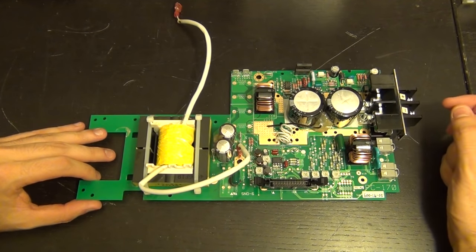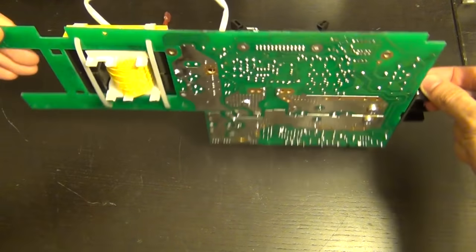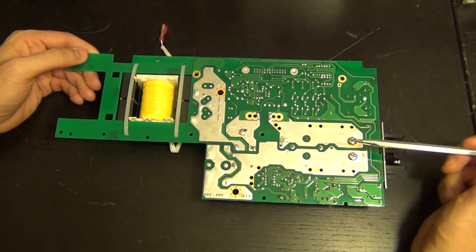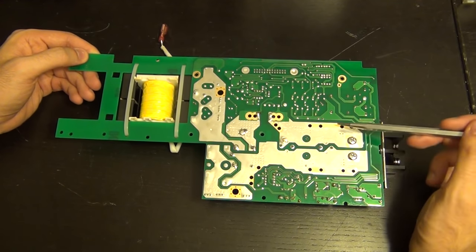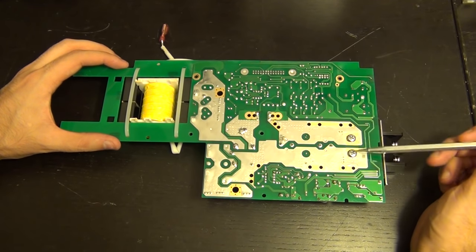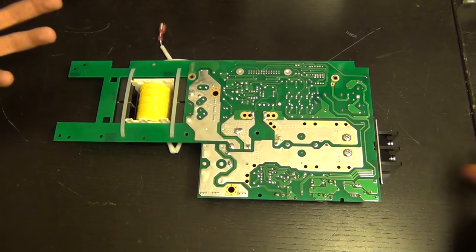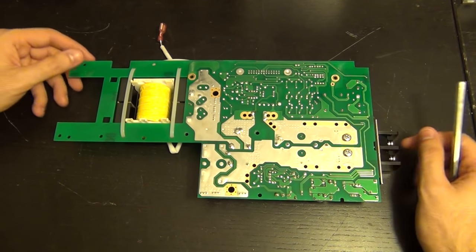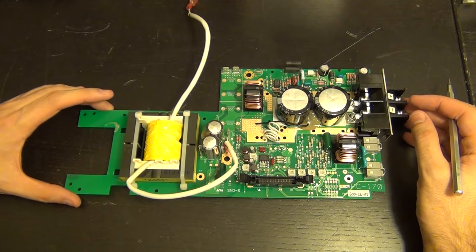Here's the entire output board — a modular design with the failed capacitors visible, and the output terminals. We've disconnected the minimum number of things to remove it from the chassis. At the back you can clearly see the classic technique of adding solder layers to double the PCB traces and increase current handling capability and lower resistance. They've also blocked out areas around screw terminals to ensure better contact and avoid relying on soft solder — nice design at the back.